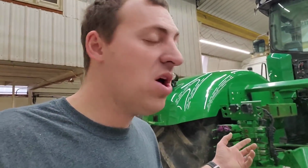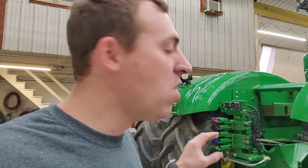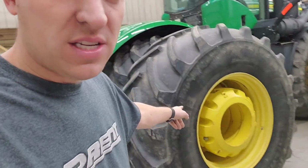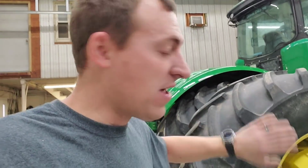Well, this past summer, I didn't want to put those weights back on when we started doing some ripping, because we needed to get the wheat stubble done to seed our cover crops down, all of that stuff. But Dad was still using this tractor on those scrapers, and those scrapers put a tremendous amount of weight on the drawbar of this tractor, and so you don't want any added weight, or as little added weight as possible. Now, it's too hard to take the big donut weights out of the inside, but I could leave the suitcase weights off, and then these weights, they go on and off pretty quickly. So I was able to put them on to do the ripping that I needed to do, kind of a compromise. I put some of the weight on, but not all of it, and then take them back off when Dad wanted to run the scrapers real quick and easy.